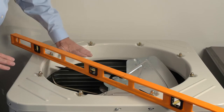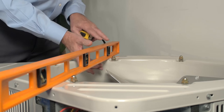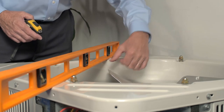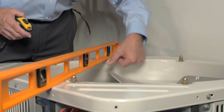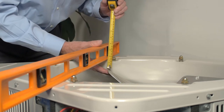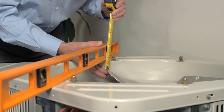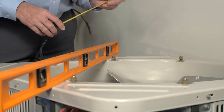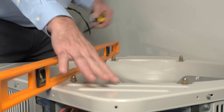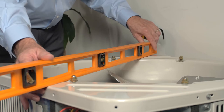In the case of this condensing unit, we want to make sure that the fan blade is in the same position when we replace it. To determine that, we'll measure from the bottom of this straight edge to the top of the fan blade. When we put the new fan blade on, we'll position it to that same dimension. In this case, the distance from the top of the fan blade to the bottom of the straight edge is one and a quarter inches. So when I replace the fan blade, I'll put it on the motor at one and a quarter inches. Be cautious that this is level — there are ribs on this particular condensing unit. I would not want to put the straight edge on a flat surface on one side and on a rib surface on the other side.